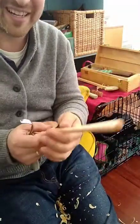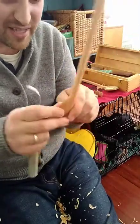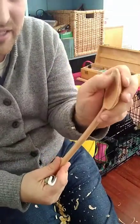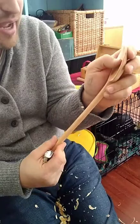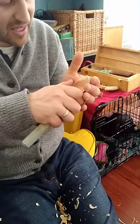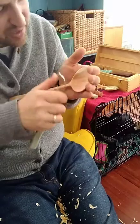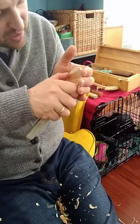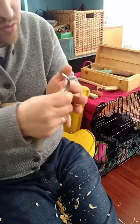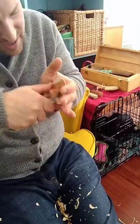It is at that appropriate level of delicacy — except right up here at the tip. I find the tip is often the last part to actually get thin and clean enough. The way you get this part is by doing straight cuts down from here, pulling down from the tip of the bowl toward the center. Until you do those cuts, you never quite carve that center front edge truly thin enough and it ends up flatter than the rest.